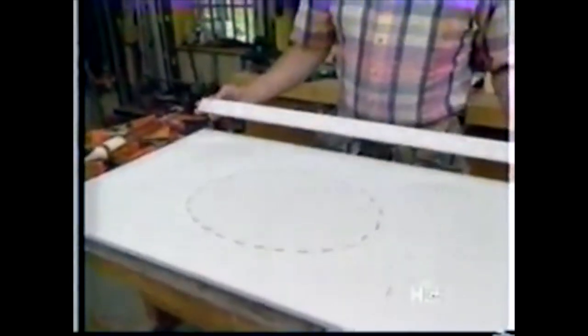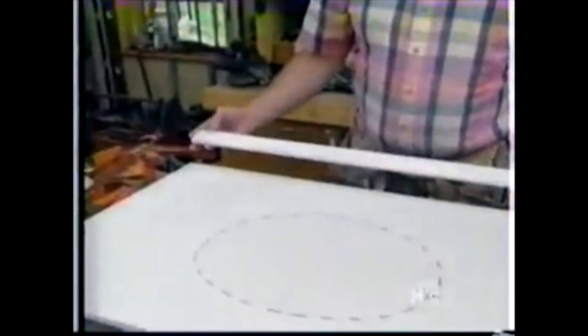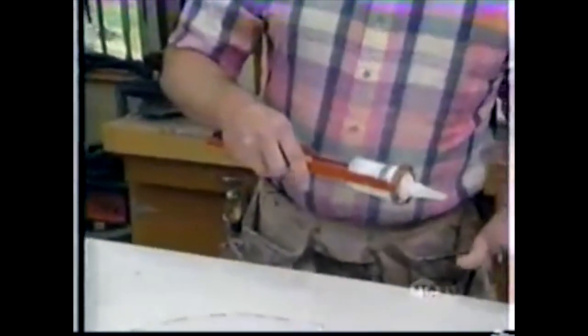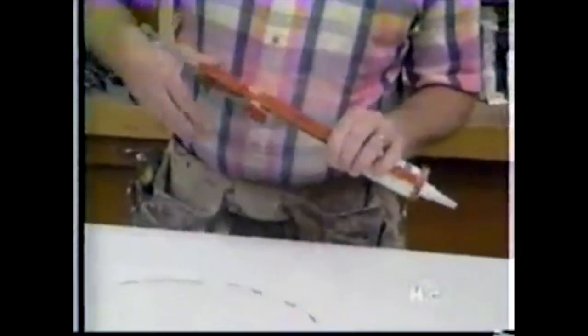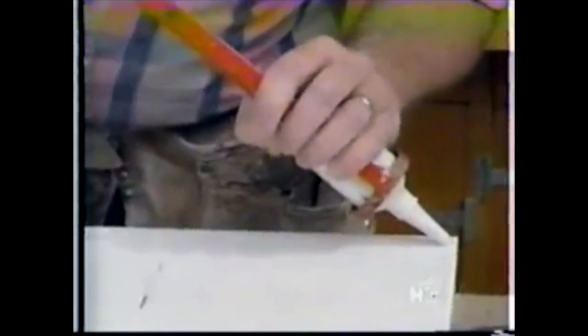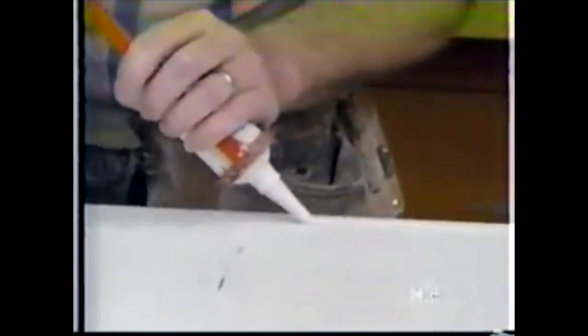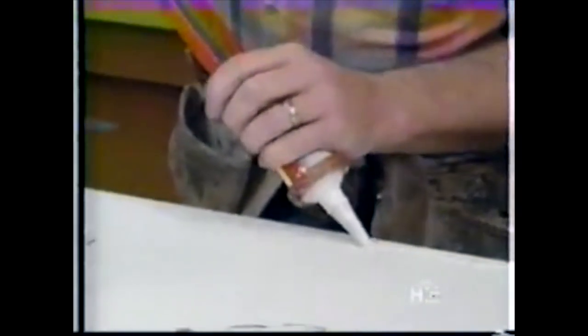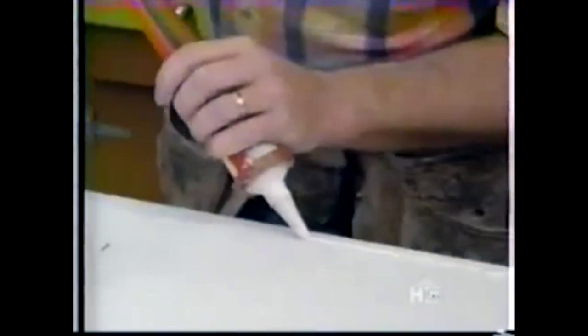I've sanded all the surfaces and cleaned them with alcohol according to the directions from the manufacturer, and the manufacturer supplies an adhesive which is color matched to the solid surface material. Now all I have to do is put a seam down the edge of the adhesive and clamp it in place and let it dry for 45 minutes before I can machine it.